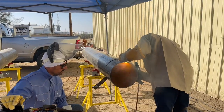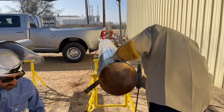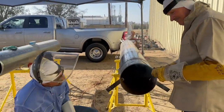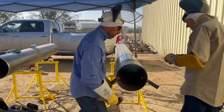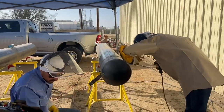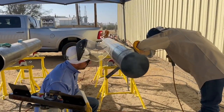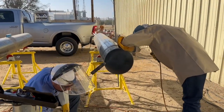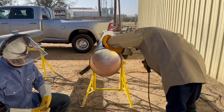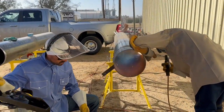You just saw Daniel hand me a rod while I was still welding. That's not a video trick — that is a technique when you're pipelining, which is mostly what I've done all my life. I do it the same whether I'm doing production pipe or a pipeline. It is a trick for speed. I have that rod in my hand, running beads with the other one one-handed. As soon as I stop, I throw that rod down — usually on the ground; don't worry about catching rods. I roll my hand over, put the rod in, and I'm back in the game. It's a little bit like NASCAR.